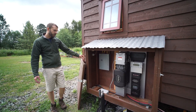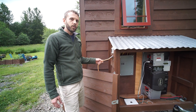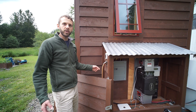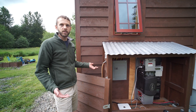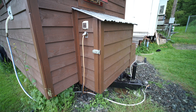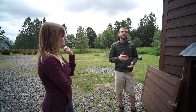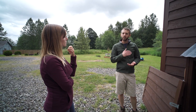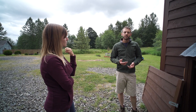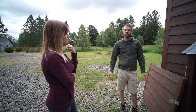When I mentioned being connected to the grid, we have just a standard extension cord over on the side. When the sun isn't out and we're not getting enough power, this will automatically reconnect and grab power from the grid to either charge the batteries or run into the house, or both at the same time. We actually worked with a third party, Whidbey Sun and Wind, to set up our system and do all the planning. They had us fill out a solar calculator where we listed all the different items we planned on using, how much power they consume, and how long each day we planned on using them. Inside our house, we kept our lighting all LED, so that barely takes any power.